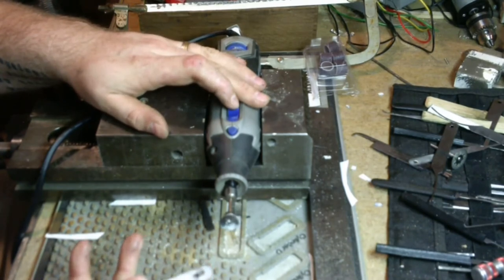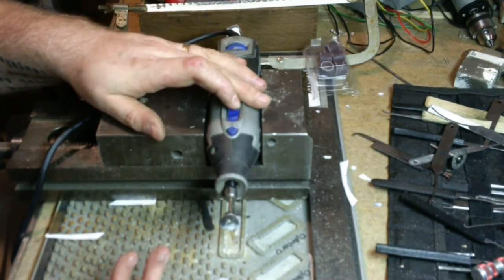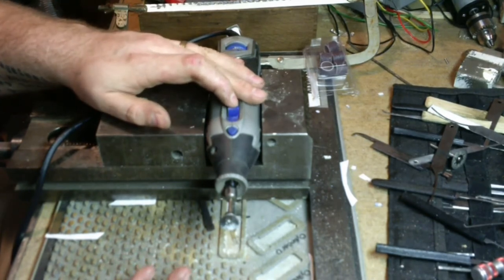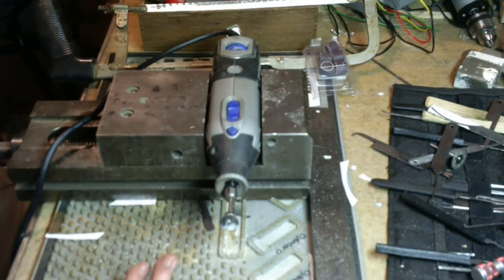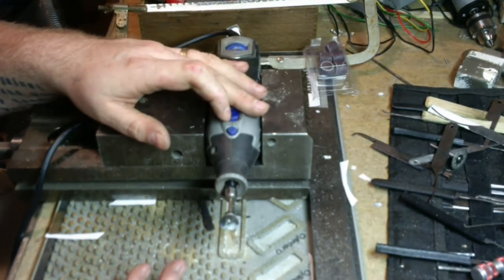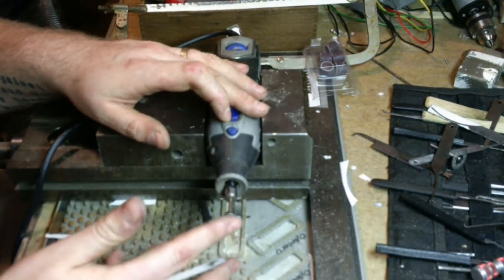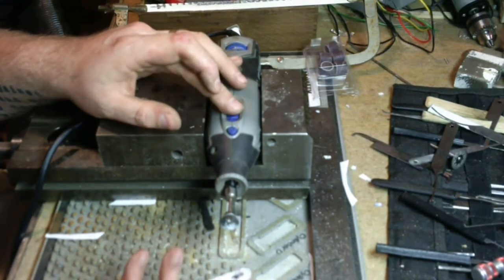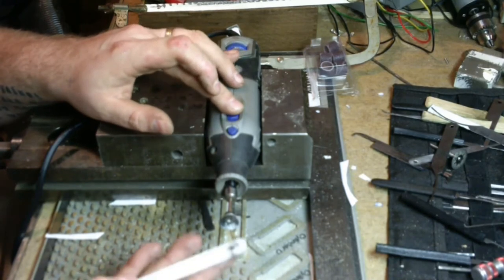Again, heat. Watch for heat. If you want to do a chemical process to remove the paint, I'd actually recommend that. It's pretty baked on there, though, so I think you'll end up with a tool anyway. But a wire brush isn't bad. As long as you control your pressure, you can control your heat pretty well. Plus, we're beyond the template stage, so we can just quench. We don't have to worry about losing any ink or any paper or anything like that.